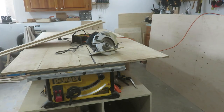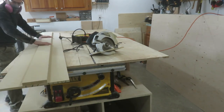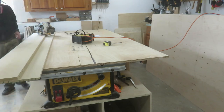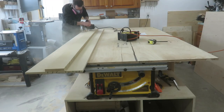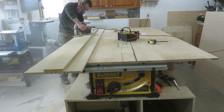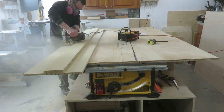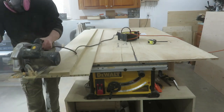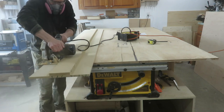To save on materials, you don't have to make this double-sided — you only need the circular saw to be able to glide along one edge. If you do this, just make sure that you have enough room to get the circular saw past your clamp, so you need some extra clamping room.